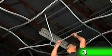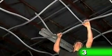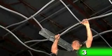In this installation, the utility circle has been specified for a location where the intersecting cross tees curve down to form a valley. Utility circles can also be specified for intersections that curve up to form a vault. There are slight differences between valley and vault utility circles. With utility circle and intersecting cross tees connected, raise the assembly into place and lock the cross tees into position just like standard cross tees.